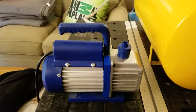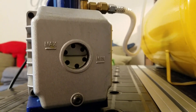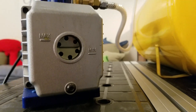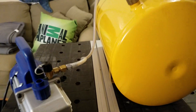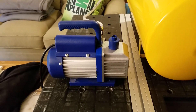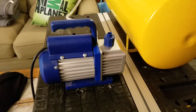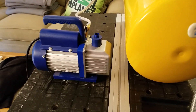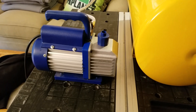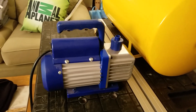It's also important if you want a good vacuum that you keep good fluid in the pump and at the appropriate level. You can see it has a sighting glass on the front with minimum and maximum levels. Sometimes when you get these Chinese pumps, they come with some pretty bad fluid. I went to Advanced Auto and got fluid specific to this pump. Auto stores usually sell those types of fluid because a lot of people use these vacuum pumps to recharge their AC system. Once I put better fluid in instead of the fluid it came with from Amazon, it basically didn't burn through any fluid — it remained a lot more stable and I have to top it off a lot less frequently.